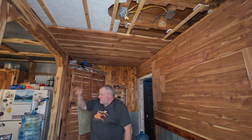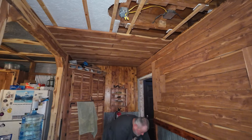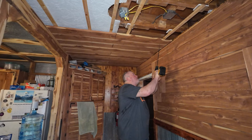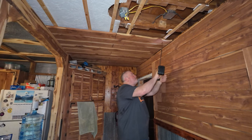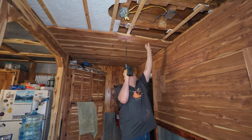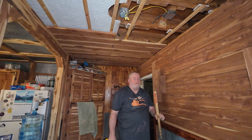What a mess this stuff makes. These are becoming a fight right in here because they go inside where that beam is — the top of that beam. That last one kicked my butt. Listen chair, there ain't room in this town for me or you — let's go. Fortunately every other one there are two little boards and those are a lot easier to get out with shorter screws. This is not a fun task. I remember putting them up — it wasn't fun putting them up either. If you ever do this with lumber from the lumber yard, let it cure first. I didn't do that with this and it shrunk.